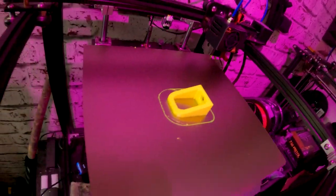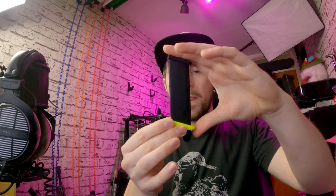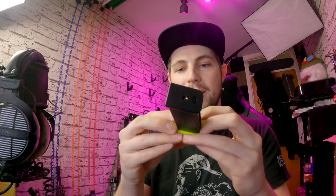It is finished — look at that, it's done and it looks pretty neat and tidy. Let's crack it off the bed and hope that the mag fits. In an ideal world the mag will just slide straight in without any issues — fingers crossed our measurements and tolerances were correct. And look at that — that's not too shabby. It is a little bit tight in there, tighter than I'd like, but I think that's the remnants of using a thicker layer height — thicker layers push out more material and tolerances end up slightly off. With a little bit of wear it's already loosening up, so I'm pretty happy.